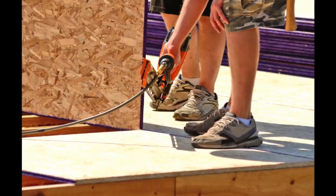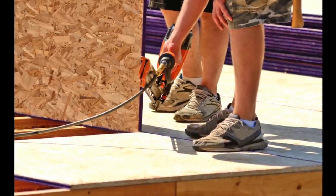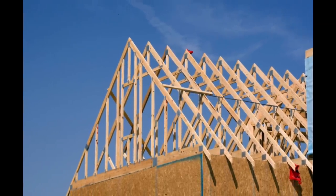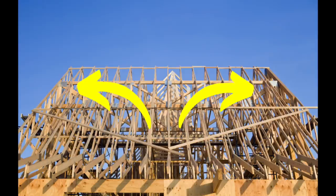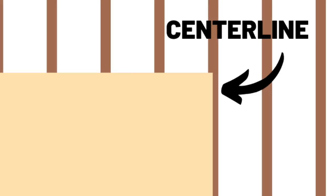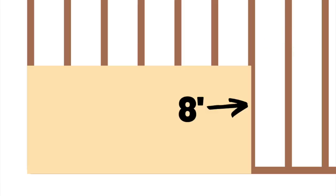For instance, when framers are building a floor system or installing trusses, they'll use factory edges to determine the alignment of certain framing members. Trusses in particular tend to bow and lean before they're secured, so framers will establish the first piece of sheathing in the lower corner of the roof. Then they'll use the outer edge of that sheathing to tell them where the center line of the outer truss should sit — essentially dragging the truss into line, knowing it's right because that edge is a perfectly square line at eight feet.